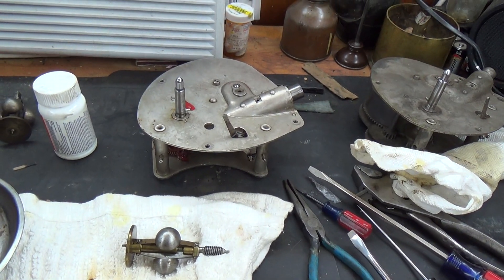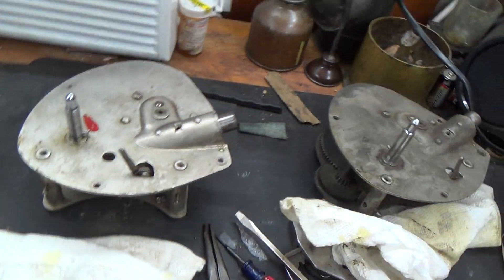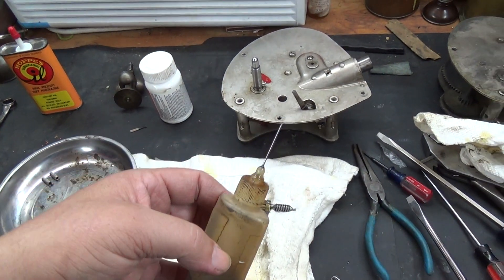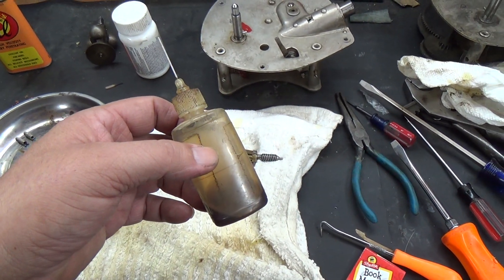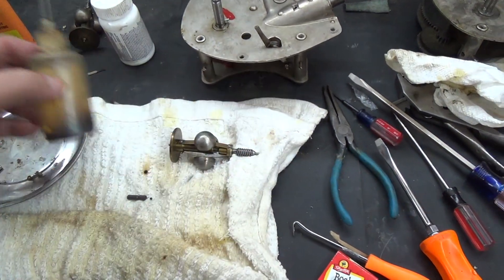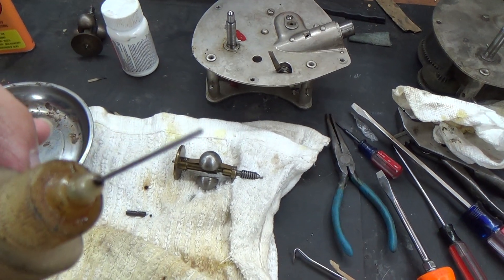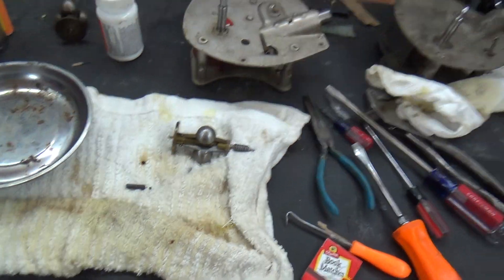That way your machine will last another hundred years and your great-grandchildren will be able to play it. These are mechanical devices — they must be properly lubricated. You'll also want to get something like this: it's a clock oiler, but it works perfectly for phonograph motors and any small device. I pick these up at flea markets and tag sales whenever I see them. This long little shaft makes it very convenient for getting into tight places, just like these bearings.